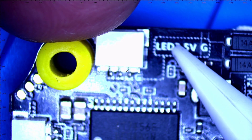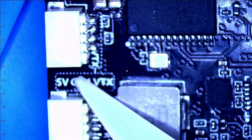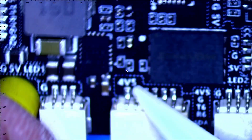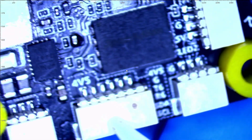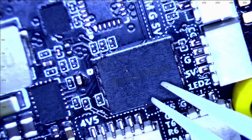Flipping the board over for a quick peek at the back connectors. You've got: LED, 5V, ground, VTX, 5V, ground, UART — probably for smart audio — then ground, 5V, LED 1, LED 2. There's a 4.5-volt pad here showing it's USB-powered, another 4.5-volt, ground, full UART, SDA, SCL, and GPS so you can work on GPS connected only via USB. You've also got the main connector we used to power the board, all pads broken out, and a 512 megabyte onboard data flash chip.